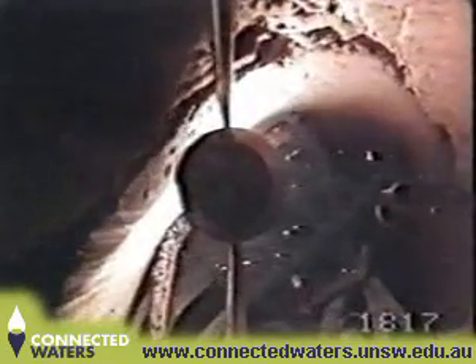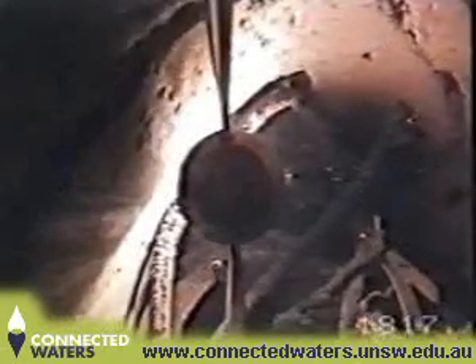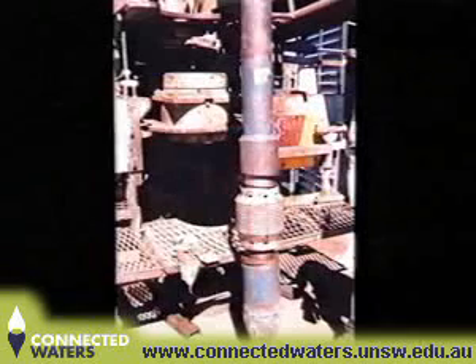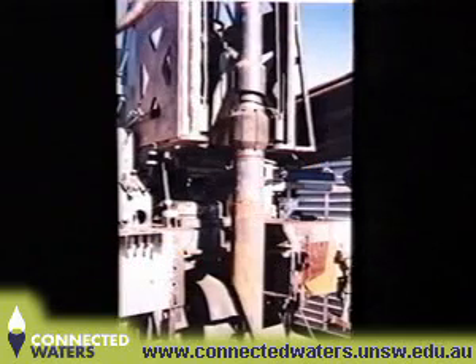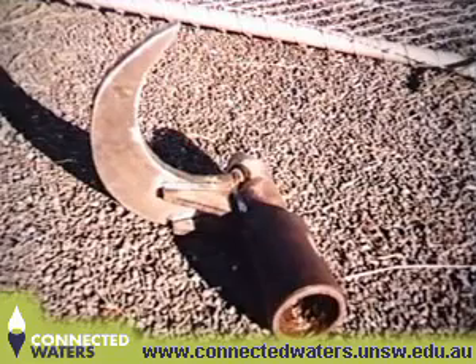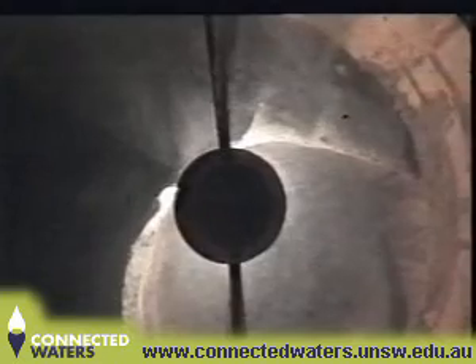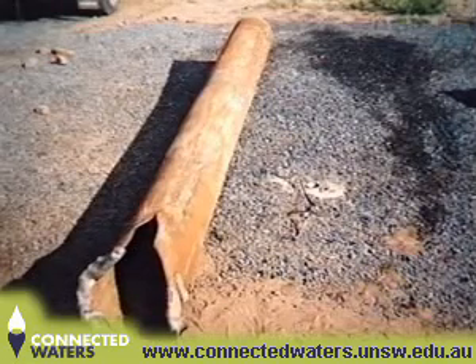The camera was then run again, showing the pump cable sitting on top of the packer. This was pushed out of the way, and a bow and casing spear was used to try to grip inside the packer and casing string. This was unsuccessful. The casing spear was run using a tapered guide and an offset tool, but this wouldn't catch onto the casing. A different guide was used, but it also was unsuccessful. A hook was then used to centralise the casing. The casing spear was run and managed to get inside the casing. On withdrawal, the smaller casing caught the lip of the 406mm casing. A more powerful drilling rig was brought on site, and the 3m section of 273mm casing was removed from the bore.